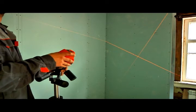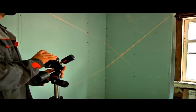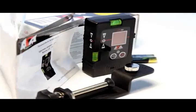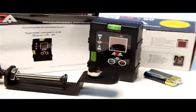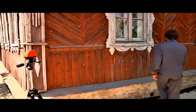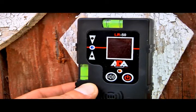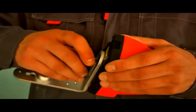With the compensator signal deactivated, the device can be used to mark slanted lines — for example, when building stairs. An LR-50 laser beam receiver can be purchased additionally. This will enable the laser level to be used in bright light and over long distances when the laser line is virtually invisible.